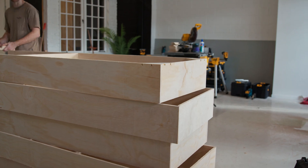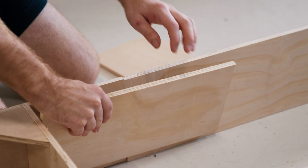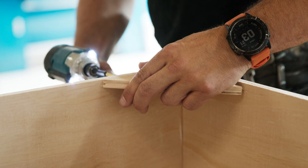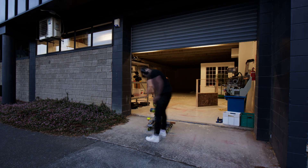We've got the boxes made, so there are a couple more steps before we add the insulation. We're going to add reinforcement in three ways. The first is by adding a plate to join the two boxes together, allowing them to run the length of the room. Most importantly, we're going to add little triangles into the corners of the boxes — this will hold them nice and square and provide a mounting point to fix them to the roof. With the boxes all together, we gave them a quick sand and called it a day.